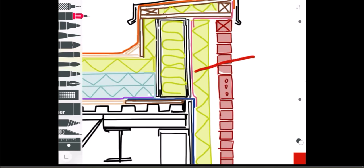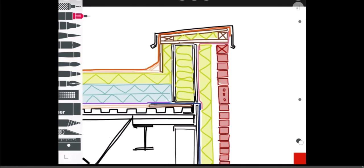I've changed the color of the membrane right here — the idea is never have two vapor barriers. You only want one vapor barrier so there's always drying in one direction. The roof membrane itself acts as a vapor barrier, so if moisture got in through the parapet and you had an air, vapor, and moisture barrier here as well, there'd be no drying potential in either direction — you'd be tanking that parapet. So this pink line is now just an air and moisture barrier — vapor permeable, no vapor control — so if there's ever moisture in the parapet, it can dry out.